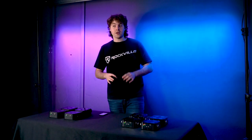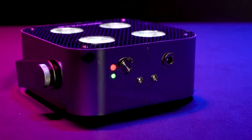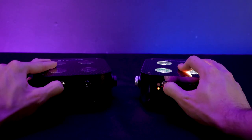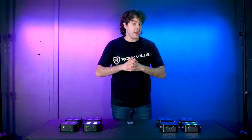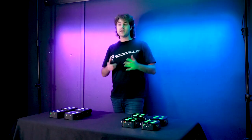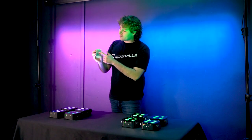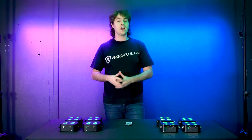You can also use master-slave to set up multiple groups of lights. Assign one master to each group with different RF groups — for example, red for one group and green for another. Set the slave lights in each group to their corresponding RF group. Set each master light to RF mode, then use the remote by switching the RF group button to red to work with one master and green to work with the other. Once each group is set up, double tap each master to activate master mode — each group will operate independently. You can also set the remote to the all-groups setting to control every light at once.